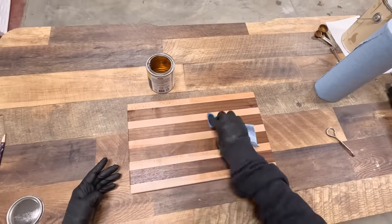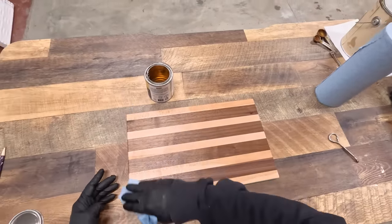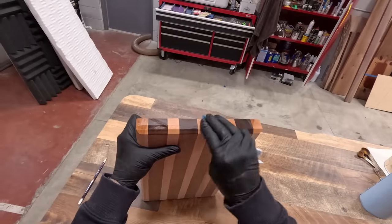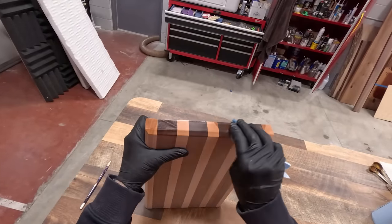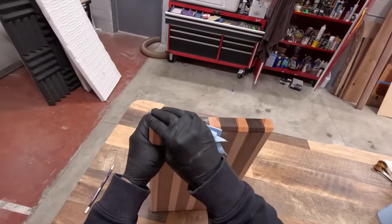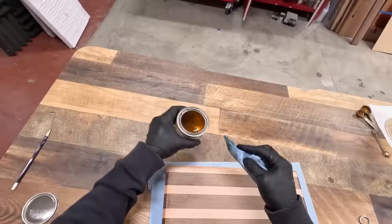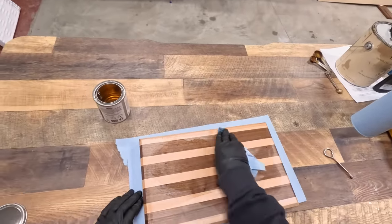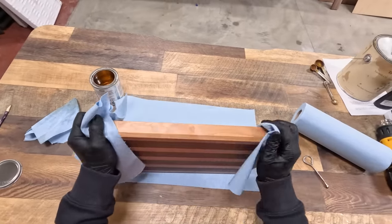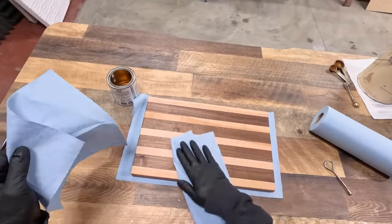I apply it very sparingly — a very light coat. We do not need to saturate it. In fact, saturating it can cause problems with the oil leaching out and taking a very, very long time to cure. Obviously this end grain is really going to drink it up and you can give it a little bit more, but don't go nuts with it. You really don't want to completely saturate the end grain because that oil needs access to oxygen in order to cure properly. After letting that soak in for a couple of minutes, I come back with a couple of clean towels and wipe off any excess — you don't want any standing material on here, just what the wood was able to absorb.